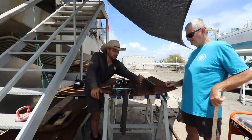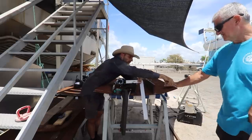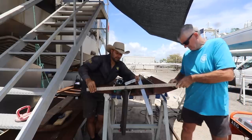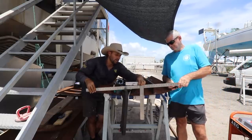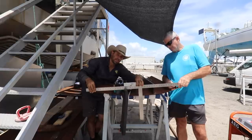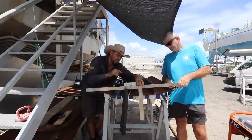So what the plan is, we've got to get these straight, and we've got to get these square to an imaginary line that goes between that point there. My lovely assistant will now demonstrate. So if you imagine that line there is the centre of our wing, we need to get these beams square to that. So we have to basically manoeuvre what we've already welded on. So we're going to cut the tacks and then rejig it and tack it back up again.